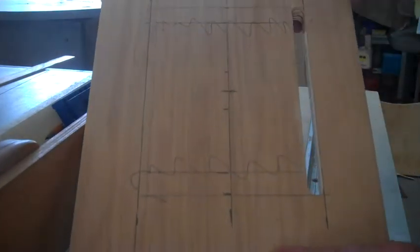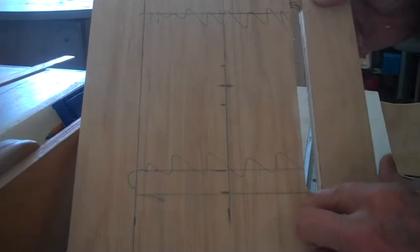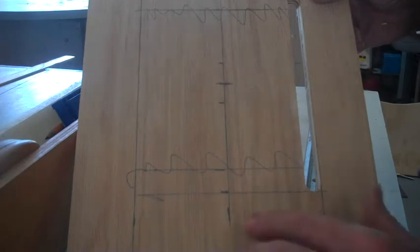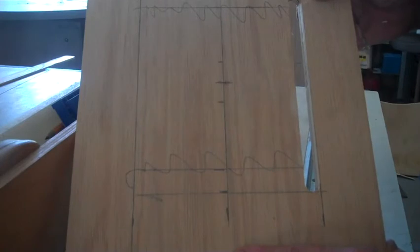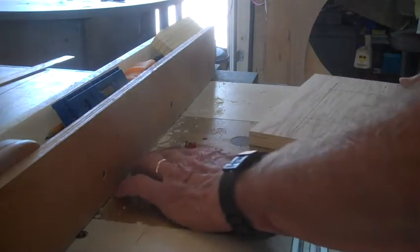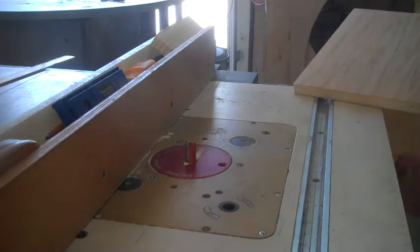What we're making right now is a jig to keep the base of my big plunge router where it belongs. I need to cut slots in the bottom of that big Lazy Susan for a 1¾ inch ball bearing by slightly under 1/2 inch to go into, and I want the pockets all uniform to the same depth and the same width and all that. So here's what we're going to do. We're going to do a plunge cut on this 3/4.